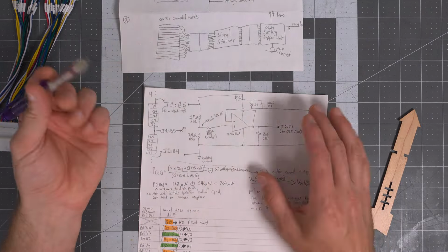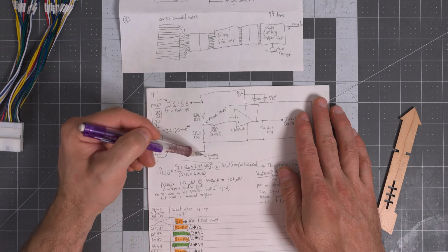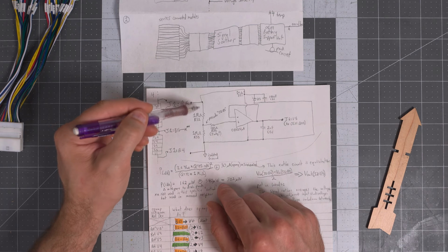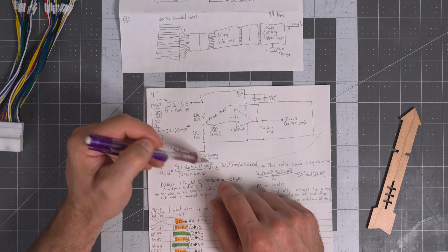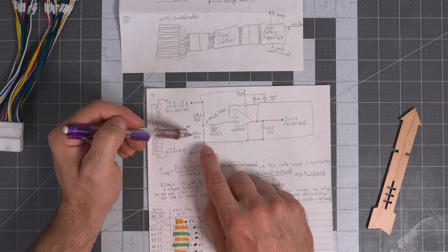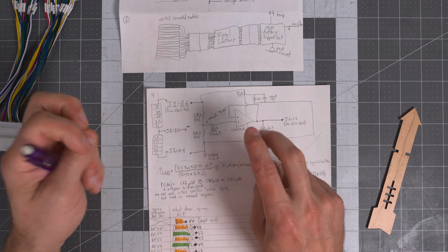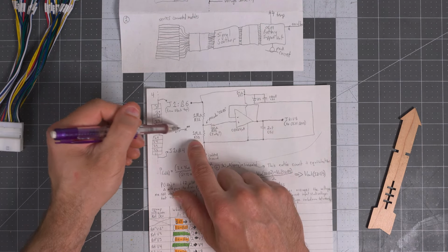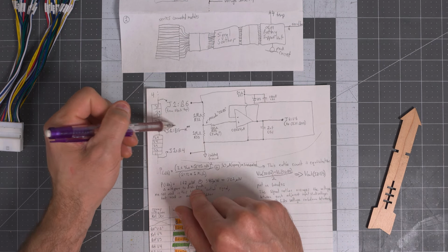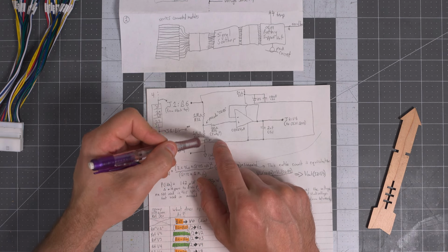So here's what we're doing. B6 to B4 has this permanent 2 mega ohm resistance, and so we are always drawing power whether the car's on or off. It's actually a really small amount of power, but I definitely noted that this is a constant drain. This is generating what I called a pseudo J1B5, so a pseudo battery 5 voltage. Again, we're only looking at B6 and B4, and we're generating a pseudo B5. And then we have a 100 ohm resistor here.